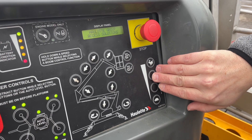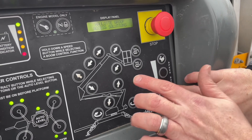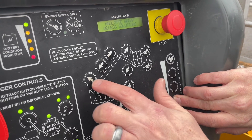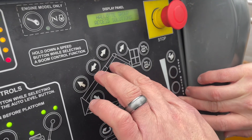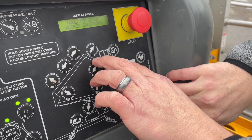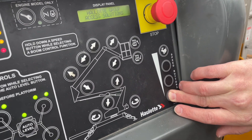When you're not used to it, starting with a slower speed helps. You'll press the speed in and then press the primary boom right here. This is your secondary boom — this one allows you to extend the machine out. This one takes the tilt of the basket and lifts it up even higher. And then this is the tilt; it does auto level as you go up.